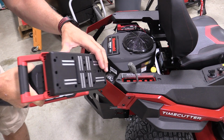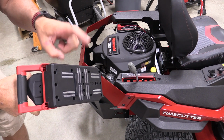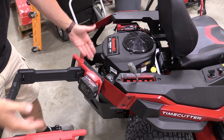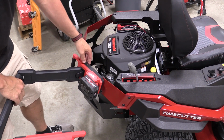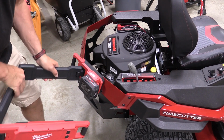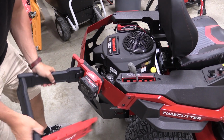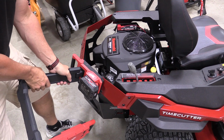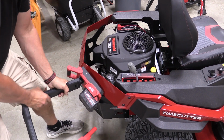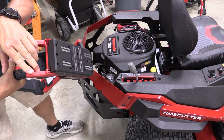This is the magnetic base that's here, and you can see there's a little piece that pushes up with this handle. That's very, very important. We stick this guy on, and I know this isn't the strongest metal out there, but we're not completely on this. Look, we can bend this around, no issue. And yes, I get it, it's thin, but it works. And this thing is going to hold here. If you were to try to take it off, which this is not how you remove it, look how far we're bending that metal out. Now there's an easier way. Obviously you just pull up on that handle and it will rotate right off.